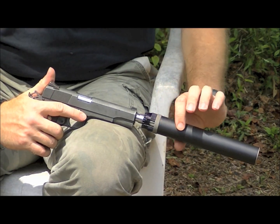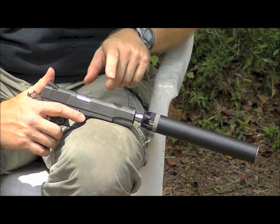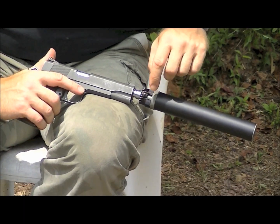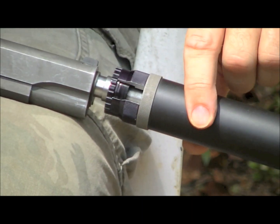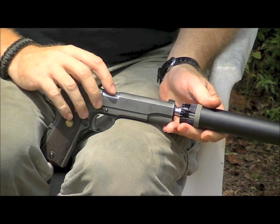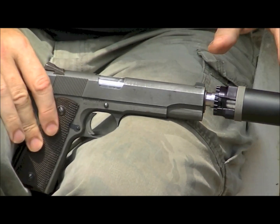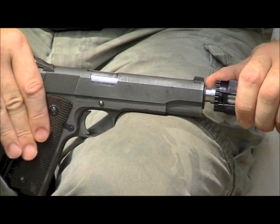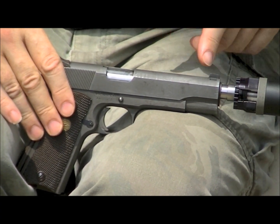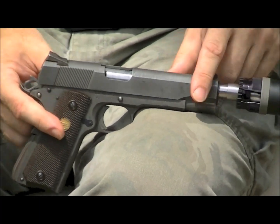The gas expulsion out the muzzle and the counteracting forces of the bullet moving downrange push that mass against the slide. Without this booster, that force is absorbed somewhat in the silencer. If the mass of the silencer is heavy enough, it deadens the recoil to the point where the gun won't cycle reliably or at all. With this device in between them, we're decoupling the silencer from the gun barrel — mechanically separating them — allowing the gun barrel to move rearward while the silencer remains static.